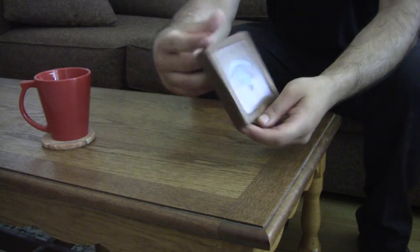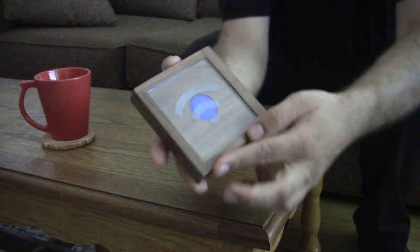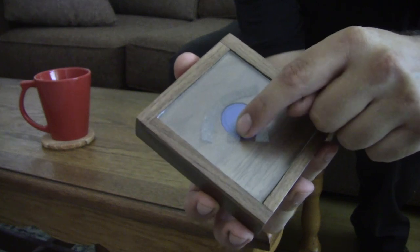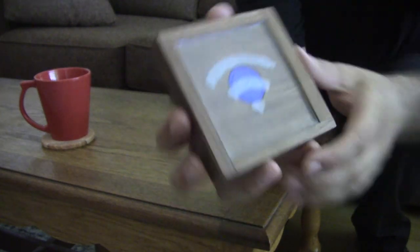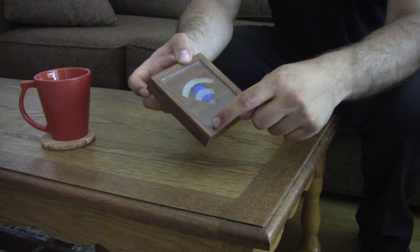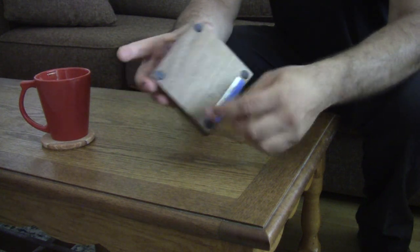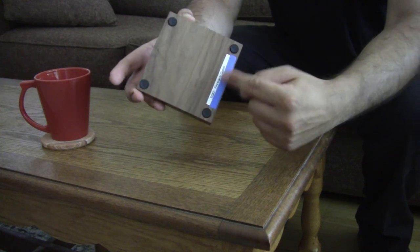And that about does it. So, lacquer spray on finish. I then placed the RFID tag in the countersink there, and then I used just 4 drops of super glue on the corners. The super glue is probably not the best adhesive to use here since it kind of fogged the glass a little bit. On the back, I then put 4 rubber feet, just little stick-on feet, and a sticky label